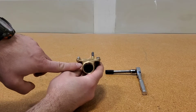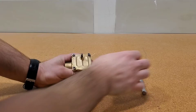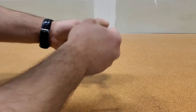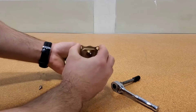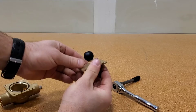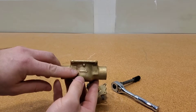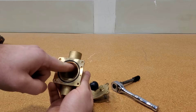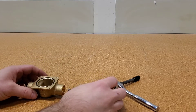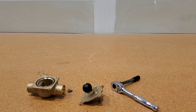The ball on the inside needs to be extracted out of this zone valve to be replaced. There are four nuts here — these are 5/16ths — so just loosen them off. This little ball is what turns flow on and off. You can see the port and all the ball does is plug the flow; when it opens it moves away and allows water to flow through. This is what I'm going to replace — that should fix the issue with this zone holding open.